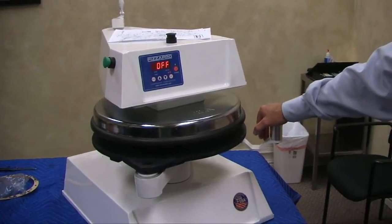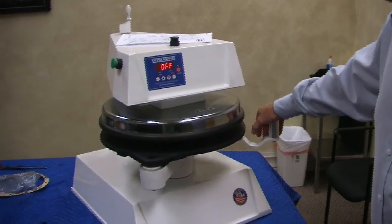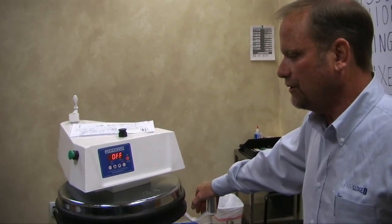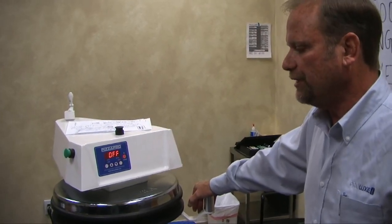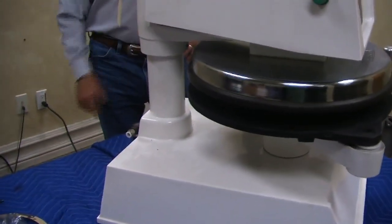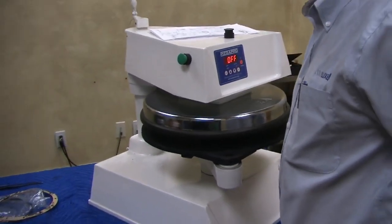For Blaze, they have their own compressor, correct? Yes, they put an air compressor in. And it's just important that they maintain that compressor. It's important that they have the right size for that compressor. We're looking for a 50% duty cycle. That's optimum. Of course, if it goes closer to 100%, it's going to generate heat from the compressor, and that heat's going to create water, and that water will come through the back and come through here, and then it'll turn to H2O when it hits that cold piston, and that's a killer for the piston assembly. It's going to wash away all the lubricant inside the piston, and we just have to be conscious of that.